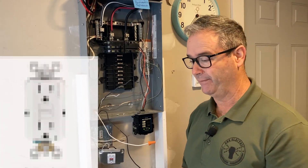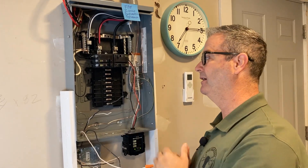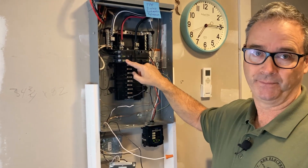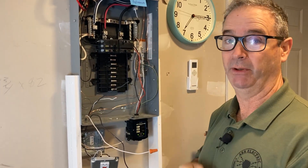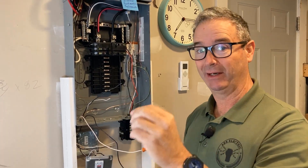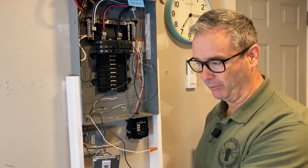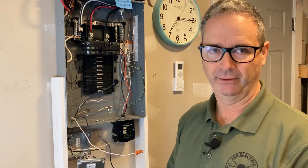Here's the hack: you're working in a 50 or 60-year-old panel and can't just stick in a GFCI arc fault breaker. So today we'll use a dishwasher as our example. In the newer code cycles, dishwashers are supposed to be GFCI protected, and the kicker is that GFCI is supposed to be readily accessible. That's a new change - it used to be just 'accessible.' Accessible means you can walk up, open a cabinet or door, and push the reset button.